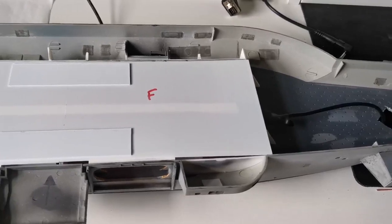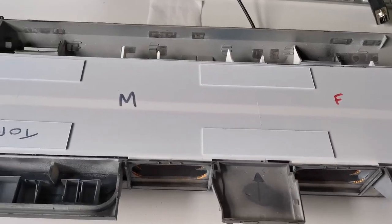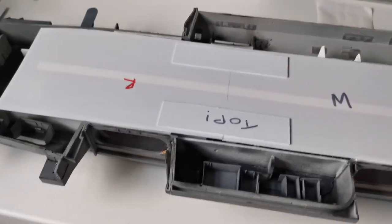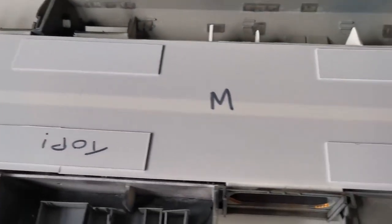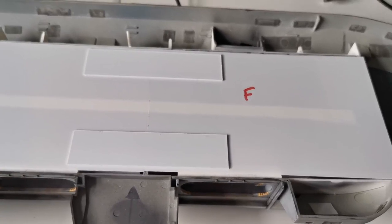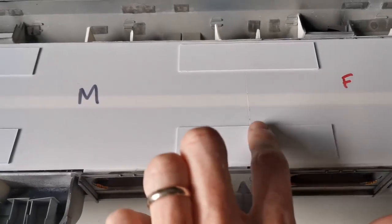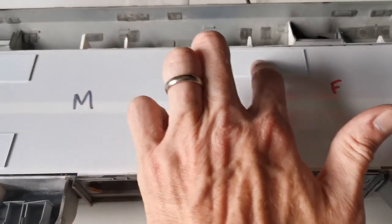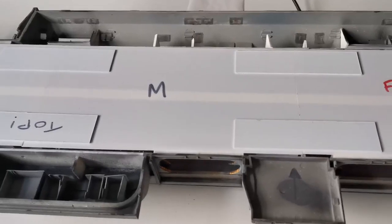So here's the innards of the Nimitz. Basically what I've done is taken some plastic card, as you can see here, made into three separate sections — a front, a middle, and a rear. They're all semi-carefully measured, making sure they're the right width. There's a few little corners you need to cut, especially back at the stern here, just to make it fit because it bends and bows a little bit. But essentially it's one big rectangle — I did it in thirds just to have a bit more flexibility and precision of the cuts. Gave it a dry fit, fitted. Then went ahead and stuck a few more serious pieces of slightly thicker plastic card on as supporting bridges and glued all those together, so it's nice and stiff.